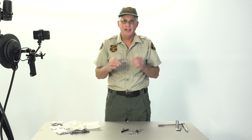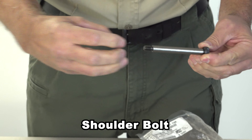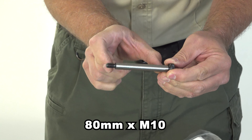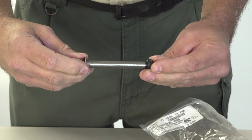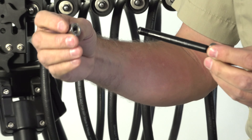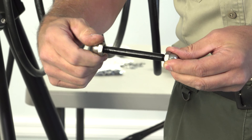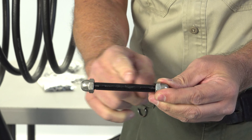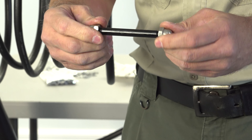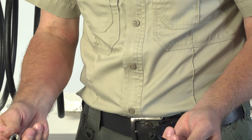For all the educated engineers in India building and designing these things - this is called the shoulder bolt. It has a shoulder here, and we can tighten something to it and maintain our distance to 80 millimeters, metric size 10. With a small washer on each side, we can keep a guaranteed 80 millimeters of distance. The way they've connected it currently is with an aluminum piece threaded on each end - the only thing stopping it from going further is an acorn nut. There's no guarantee what the distance is going to be, and I don't understand who makes bolts out of aluminum.